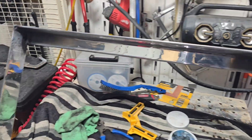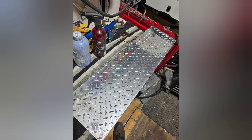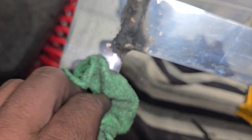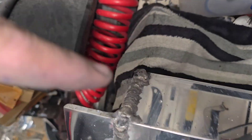Not bad — not the best, but I literally just did that one-handed while on the phone. That's what I got for my beacon mount. I'm gonna end up just sanding these things down. Aluminum is easy as hell to weld. One cool thing about polished aluminum — look how clean that got. The bead's a little bit different, but see that on the side? It's shiny again, it's as if nothing happened. I just love how clean aluminum welding is in general. Probably gonna wire brush these and might flap disc them to flatten them out.